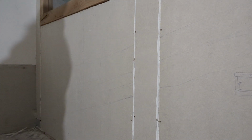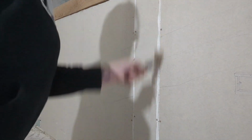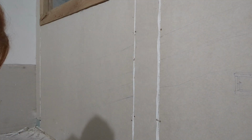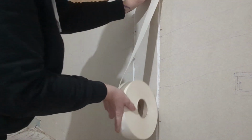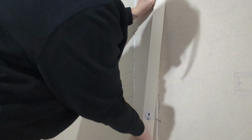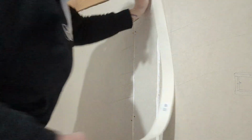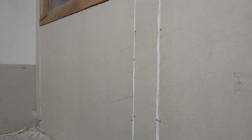And as much as I'm accident prone, not completely these days without common sense, she says. So the tape I've got is banded joint 150mm. So effectively what I'll do is I'll put the mud across and then we'll tape it down. So I'm going to bring the mud across here because it really is sloppy mud at the moment.